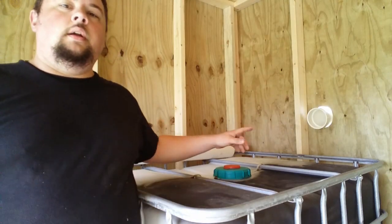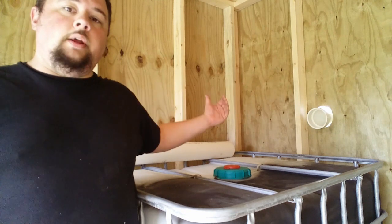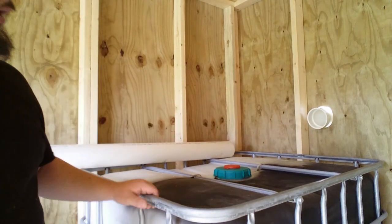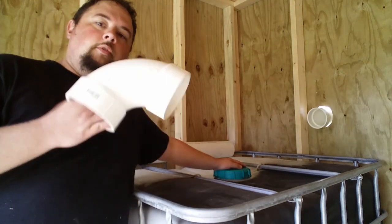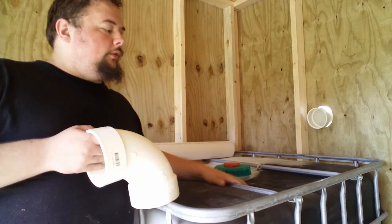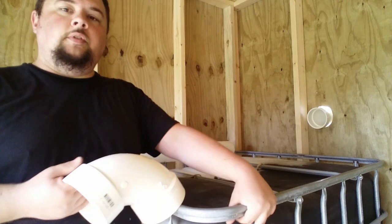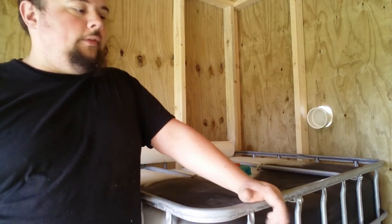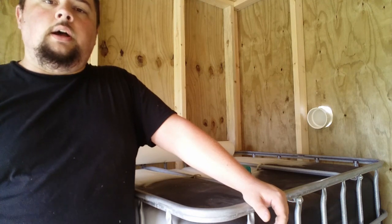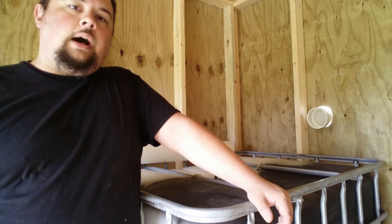Here we are inside the shed. You can see where the rain collection system comes inside — I cut a four-and-a-half inch hole and elbowed it, 90-degreed it, to come inside. All I have to do from here is run a pipe from that elbow and use another 90-degree elbow to take it down into the tank. This is a 275-gallon IBC tote — you can find them pretty cheap on Craigslist. This one specifically was used to carry lime juice. Make sure it's a potable tank if you go looking to do this for yourself. Make sure it had something consumable in it — you don't want to get something that had oil or any kind of non-consumable item in it.